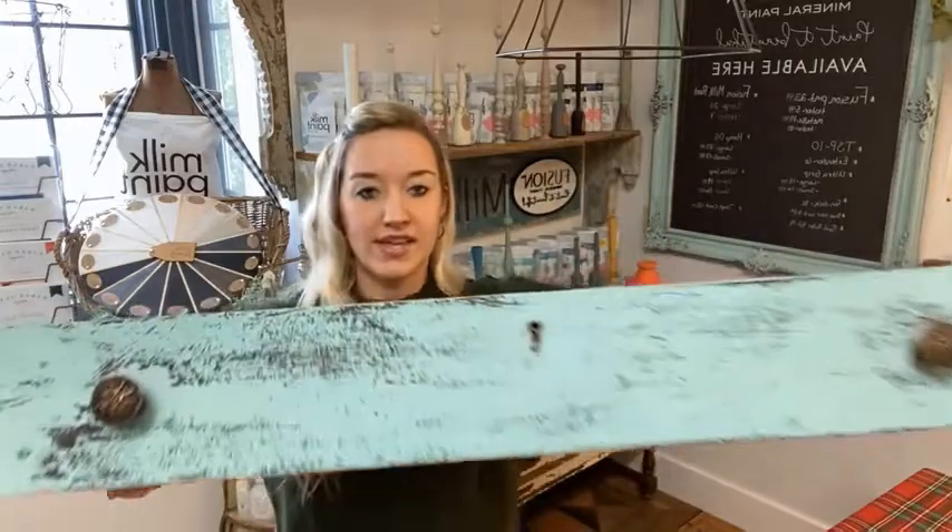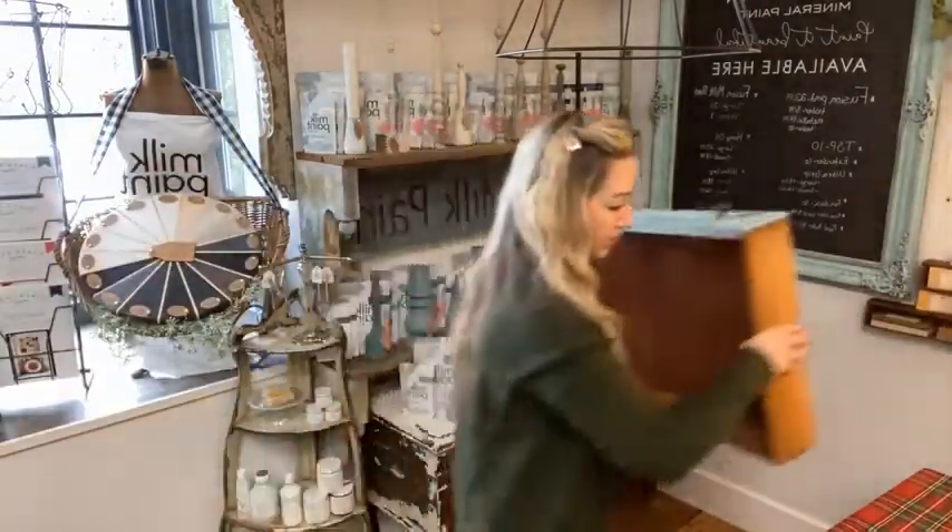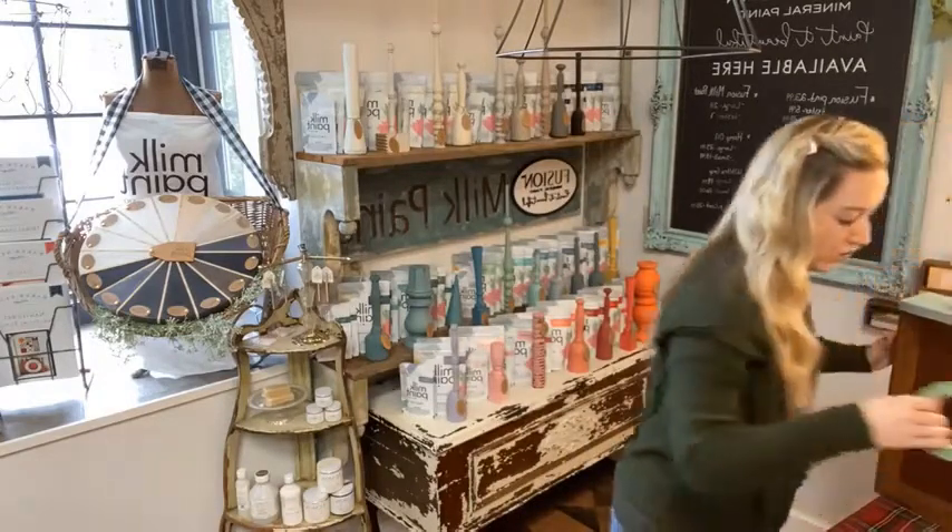Let me show you that chippy goodness — I made that happen with my secret weapon: frog tape. Every one of you should have this if you're going to work with milk paint and love the chippy look. All I did was put this tape down on my dried milk paint, and I pretended like I was waxing my eyebrows — I pushed it down really hard and ripped it off aggressively. Because I had a shiny surface, the milk paint released. If the surface was dried out or raw wood it never would have worked. I've tried this method with cheap tape and it doesn't work, so don't cheap out — get the frog tape. There have been times it hasn't worked perfectly, but eight times out of ten this trick has worked for me.